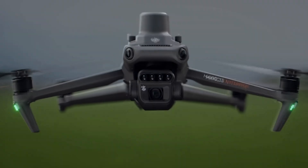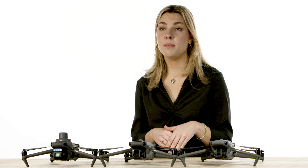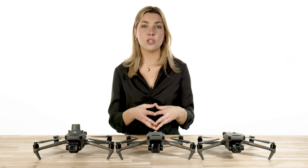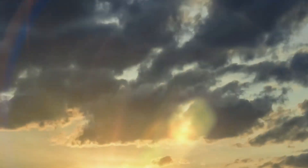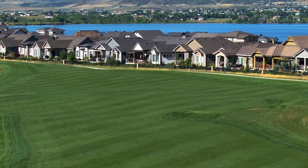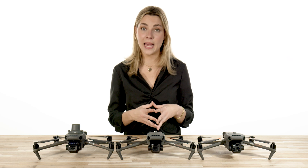The Mavic 3 Multispectral can be used for several different applications, but is primarily designed for agriculture. It gives you the ability to map out an area with the same 20-megapixel camera used on the Mavic 3 Enterprise. However, instead of a zoom camera for closer inspections, they added four individual specialty cameras: green, red, red edge, and near IR. These cameras can scan and analyze crop growth with total clarity and millimeter precision, whether it be HOA lawns to determine if the sprinklers are down before Mr. Jones' grass turns brown, or the 10th fairway on a links course. It is able to see details in the turf or your strawberry field way before the naked eye can. You can then cross-reference the data with the crop index and use online tools to determine your crop's health.